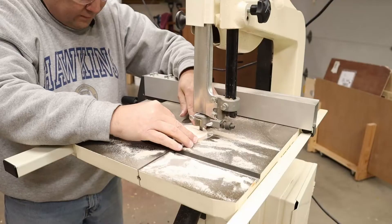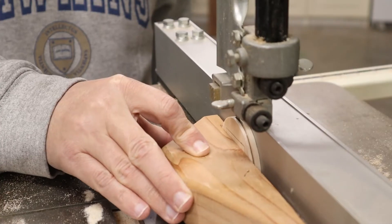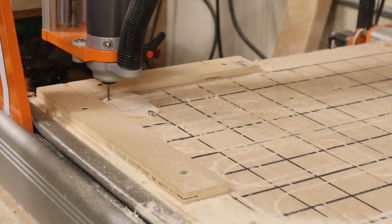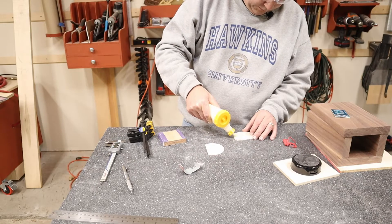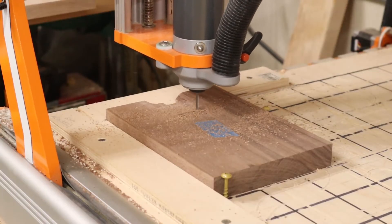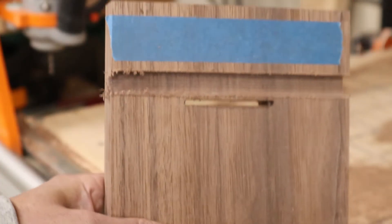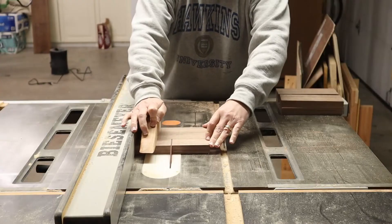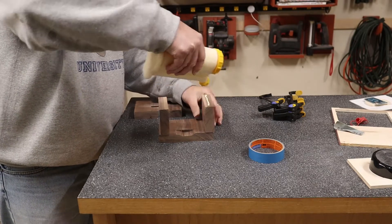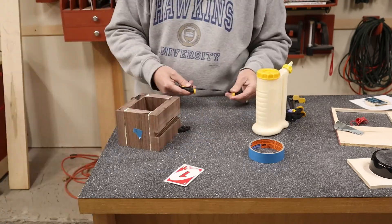Hiding the NFC reader and the wood support for the CDs when they sit on top of the box was an interesting challenge. The circle that was left over from the faceplate seemed like an interesting choice to use for this piece, but how could I hollow it out so the NFC reader could fit inside it? The simplest way I could think of was to cut it in half, route a pocket in it, and then glue it back together. So that's what I did. To completely hide the NFC reader, I needed to cut a precise slot in the top of the box that would perfectly align to the pocket I created in the CD support piece. Time to glue the box together. I went with edge grain butt joints for the box, knowing that the end grain at the front of the box would be fully covered by the faceplate. This provides a gorgeous horizontal grain for the side and completely hides the joint lines.